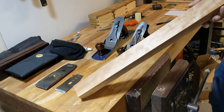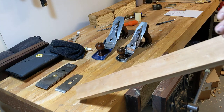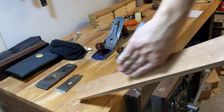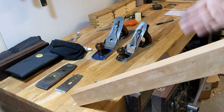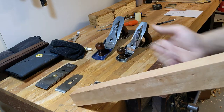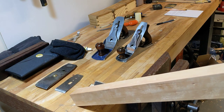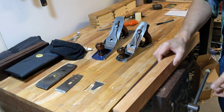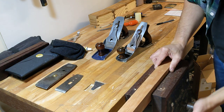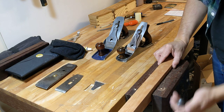No. Here's a piece of cherry. You can see I've just put some directional lines on the side of it. The grain is lifting up this way, so if you've got a choice and you had to plane it, you want to plane it in this direction - that's going to get you the best trouble-free surface finish. I have equipped this number four Stanley with a special kind of cap iron, which we'll look at after I've done the planing.